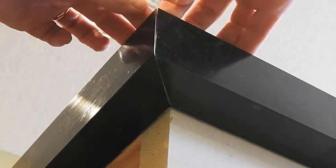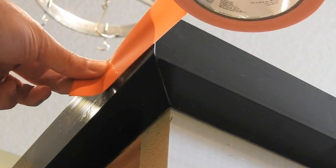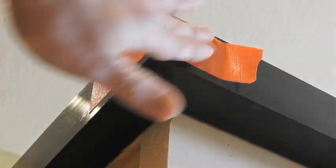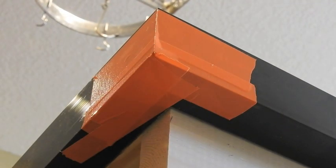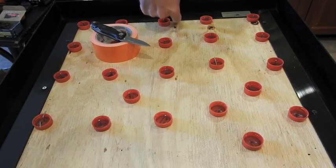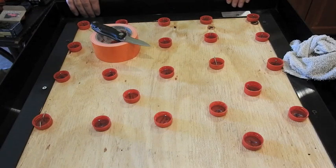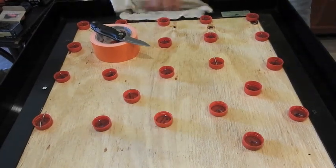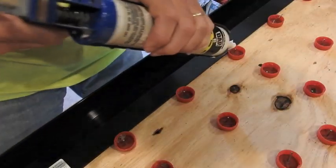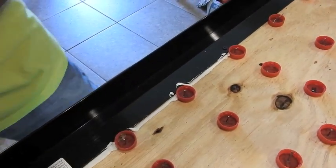On the corners of these form boards, when you put the concrete in it can pull them apart, so I'm taking duct tape to hold them together. I'll put some at the bottom to keep the water from dripping through, and we'll be caulking the insides. There's the corner fully bandaged up, ready to move on to the other three. Now the corners have been taped on the outside. I'm running a little caulk around the inside to keep the water from running underneath the form and down the side of the cabinet. In my previous countertops I've always put in an insert that made the side look like slate — this time we're going with straight sides. I'll take my finger and squish the caulk in a little bit, put a fan on it so it can dry.